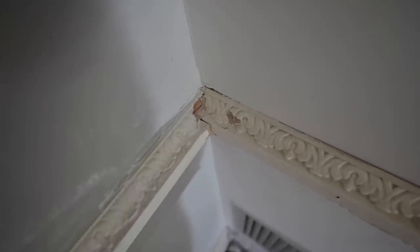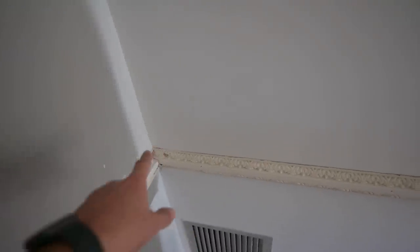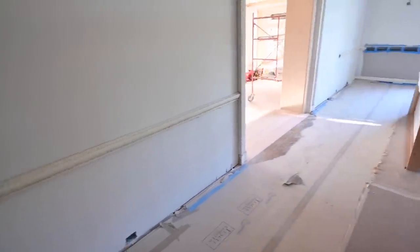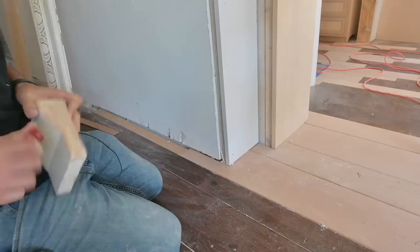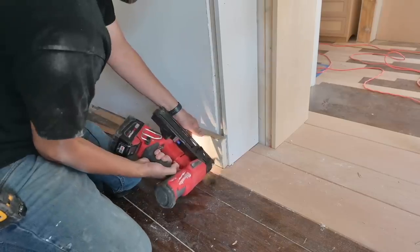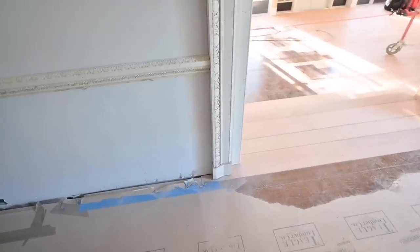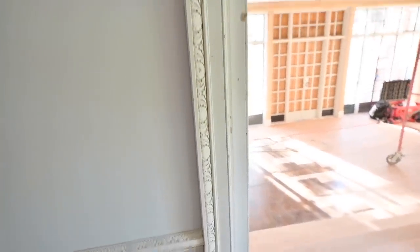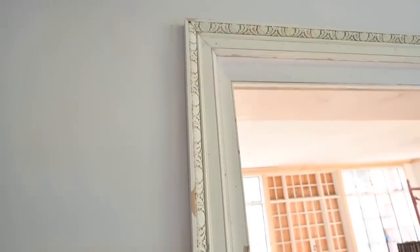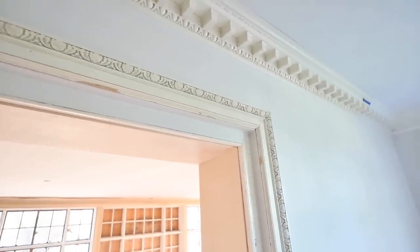Check that out — that is a crazy cope joint on that chair rail. We installed this piece; the cope was already there, so that made it a little bit easier. Then we installed the plinth blocks down here and then we have our Georgian casing, which we were able to make work. It was a pretty crazy, intense moment cutting this stuff.